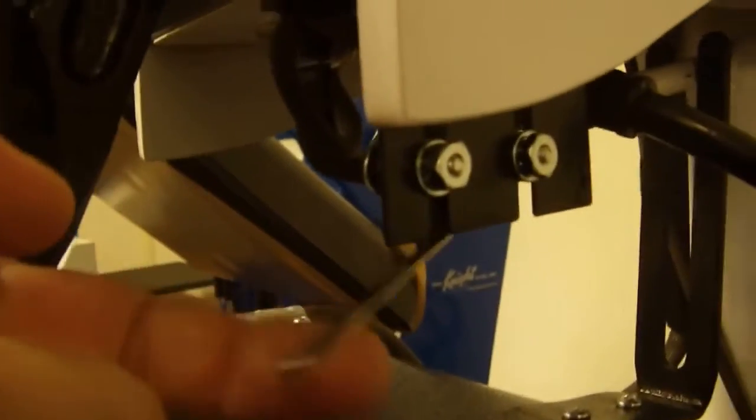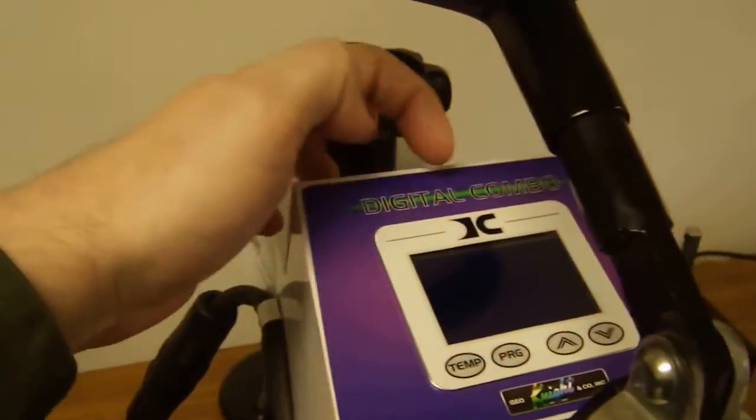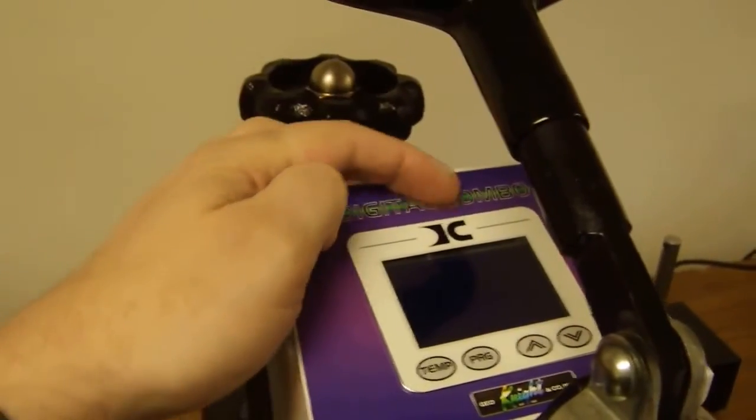If we close this, you'll see that same trigger switch right here. Make sure that's actually contacting the heat platen and triggering. Make sure that the 2 pink plugs in there, if you can see that, are plugged into the top connectors. And again, that black plug that plugs into the top of the circuit board into the 6 gold pins, exact same design as that swing-away. And that's how to resolve almost all timer issues on our swing-away presses, whether it's the 16x20 or the combo press. Thanks.